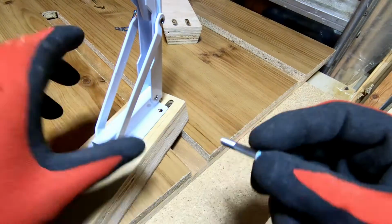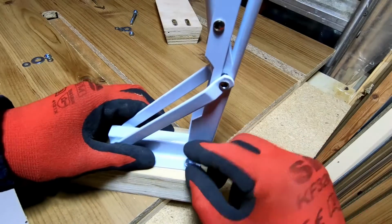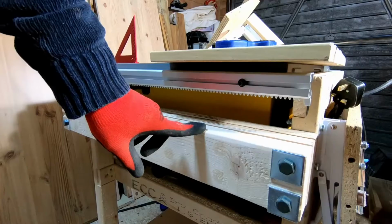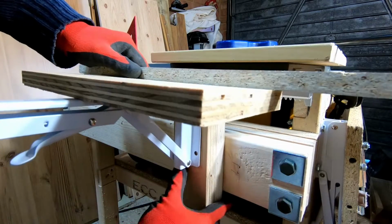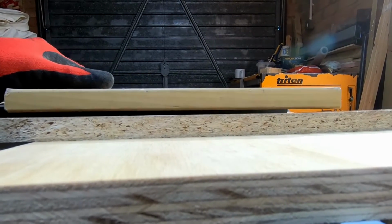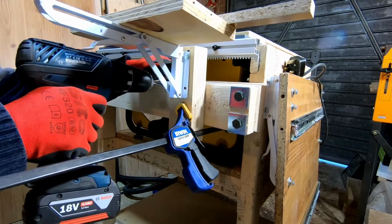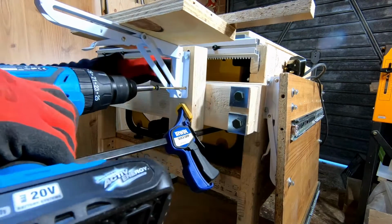The folding bracket is going to be bolted in on the top. The slots have the usual 5 cm travel in them, which will help in adjustability. And like seen in the side carriage assembly section, I used a scrap piece of plywood to get the height aligned, and then screwed in at the bottom part with these 80 mm screws.